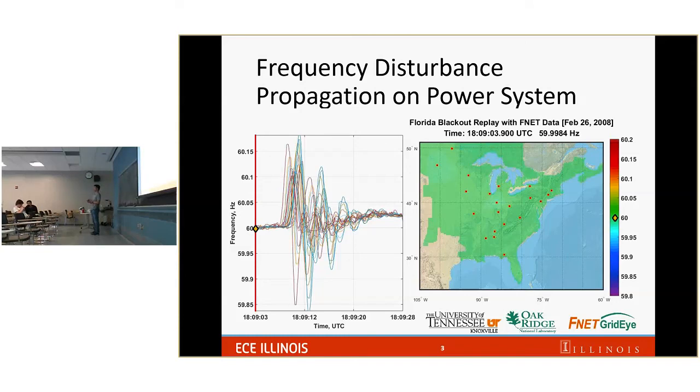So, any more questions? One more question. Maybe anybody can answer. For a typical synchronous machine, what happens to the control when such a disturbance appears? Does the torque and phase current remain constant for this kind of disturbance, or does it react to this kind of perturbation? It doesn't react. Look at the time scale we have here. It is around 4 or 5 seconds after the disturbance. The primary control of the generator will kick in to stabilize the frequency, but the secondary control to bring the frequency back to 60 Hertz hasn't been activated yet.